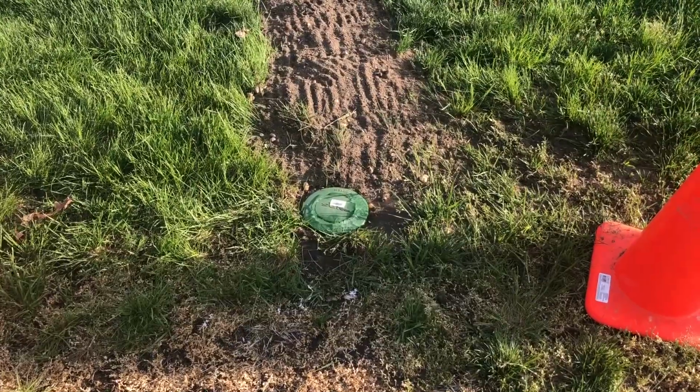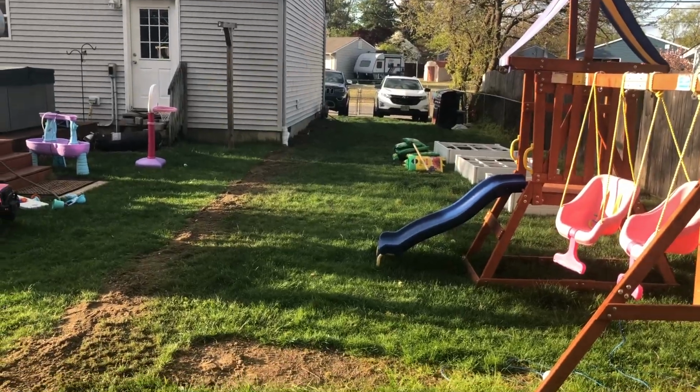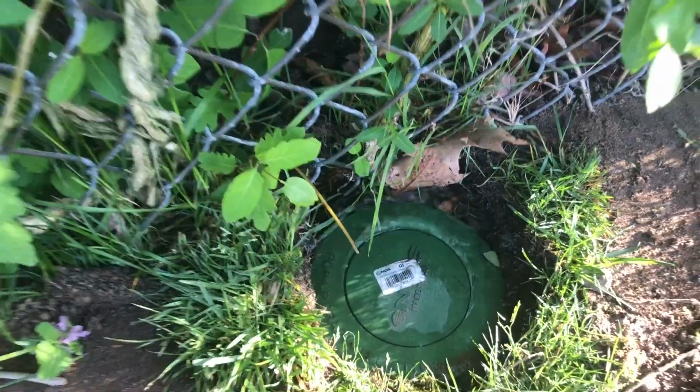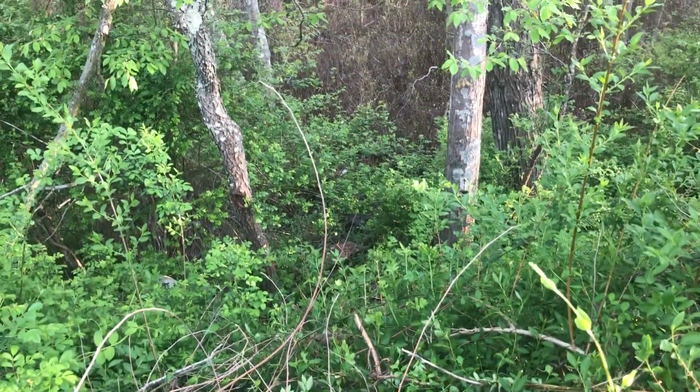Now to show how the left side works. And now for the left side of the house, got the hose in the very front downspout. Everything goes down. It's going to come down here. It's going to build up in this mini dry well. Everything's going to build up. And here comes the water now. Building up, building up. And then it's going to overflow and go down to the woods. And there we go. That's exactly what it's going to do. The water is going to come up, come out, facilitate on the other side of the fence and go down the hill to the swamplands down below.